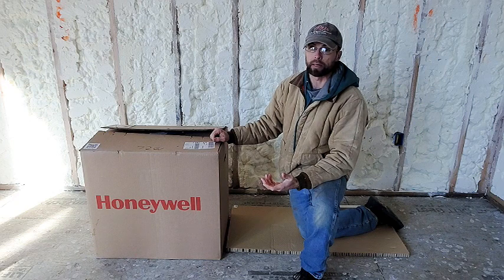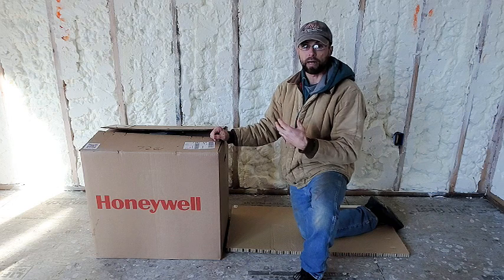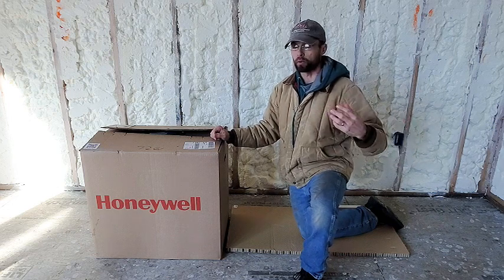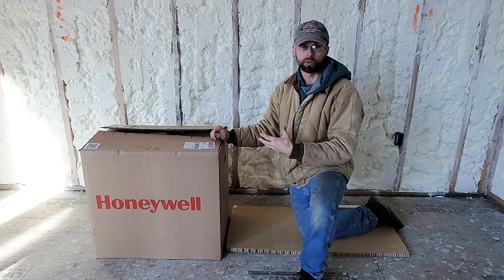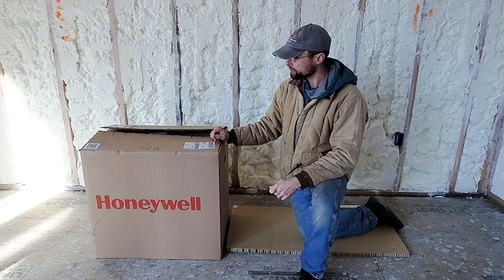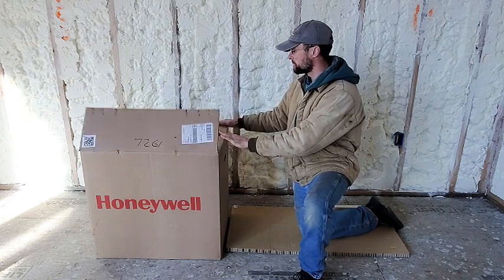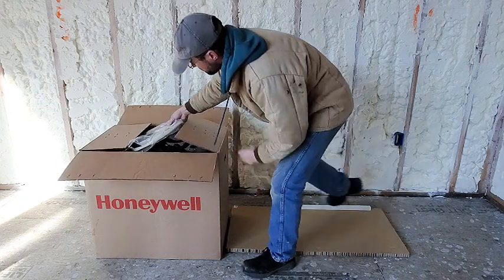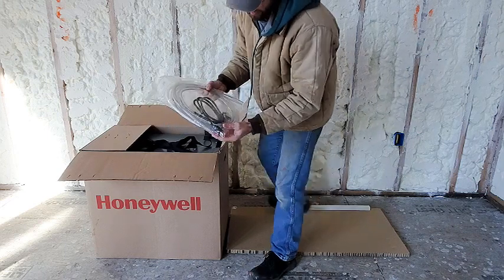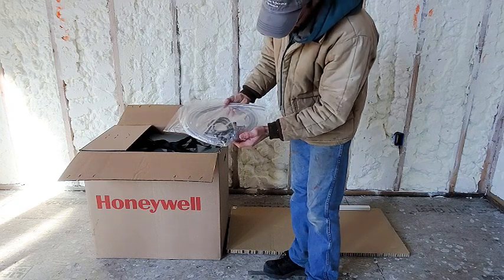You've got to consider that if you had an HRV, it's just going to be pumping 100% of the outside humidity back into your house. So if it's really humid outside, that air coming into your house is just going to blow 100% of that humidity back in, which you don't want in a very sealed environment. So this is a 200 CFM Honeywell. I opened the top and took the instructions out, but it has your condensate drain, some zip ties, your plug, and looks like some mounting screws.